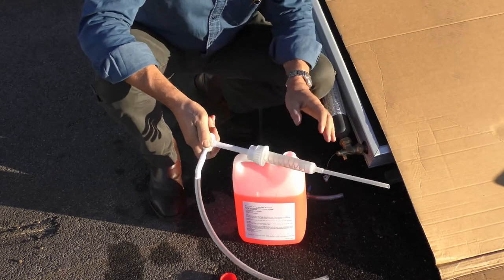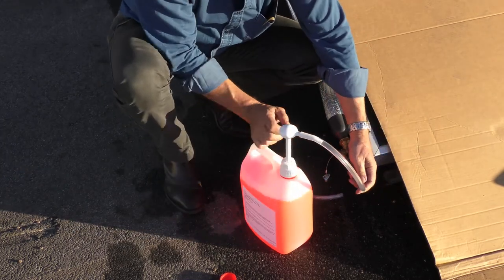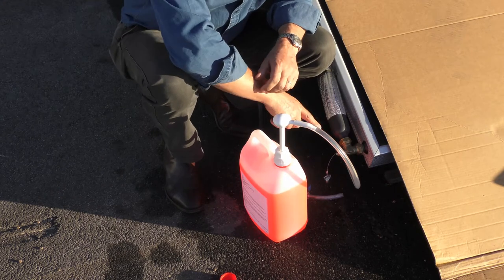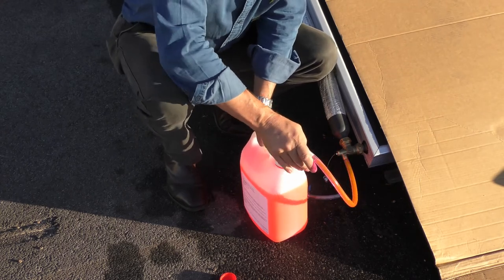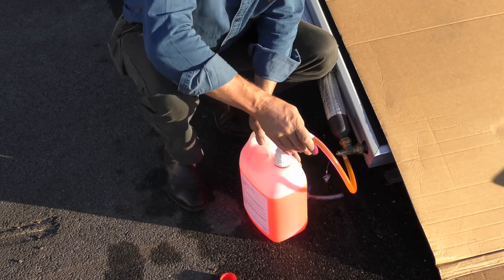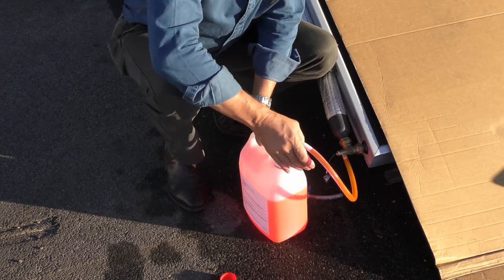Make sure that we've got that open. Put it inside our bottle, and now connect that with the hose that we've already supplied in the kit. We're going to pump it in. Make sure you go and just make sure that it's open because it's a bit tough forcing it through a partly closed tap in there. So we're going to start putting that in. You can see now it's coming in. The reason we're putting this in now is the total content of the closed circuit in the system is 15 or 16 litres thereabouts, and we want to put in more potable water to mix it all after we pump this in.